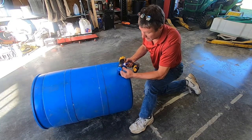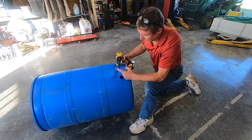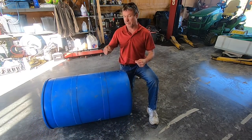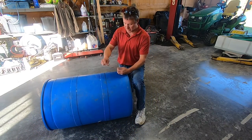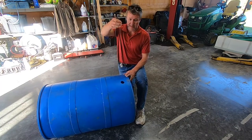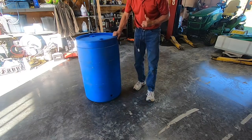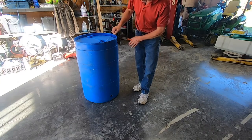There you have it — we've got our hole in. I got lucky and my plug stayed on the hole saw, but if the plug falls inside, no big deal — just tip it upside down and you can get it out through the holes up top. Now that we have our hole in the barrel, take your string with the weight tied on the end, and drop it down through the top hole until it gets to the bottom, then pull it out through the side hole you just drilled.